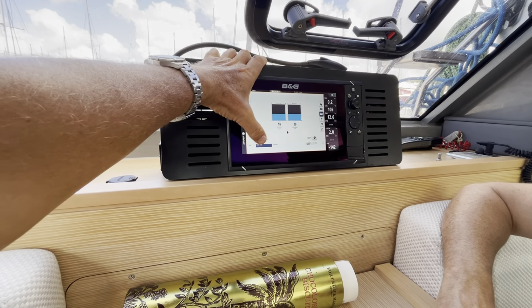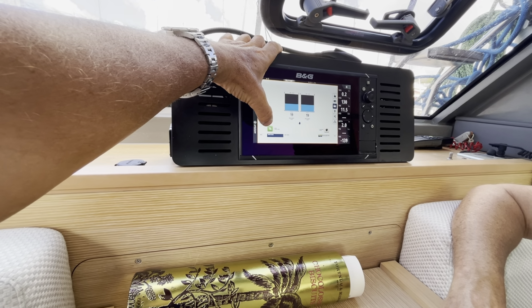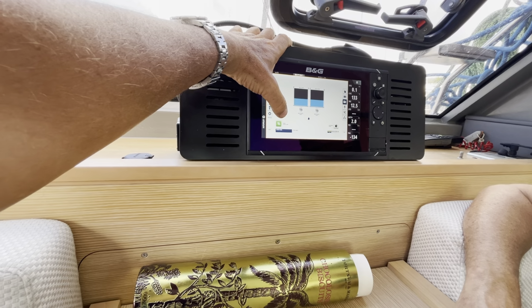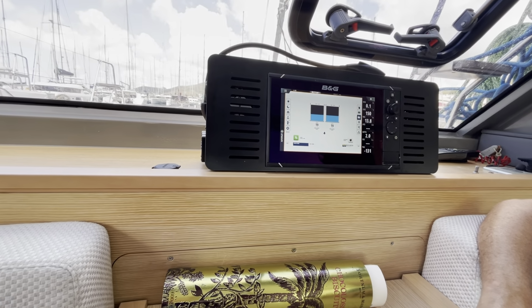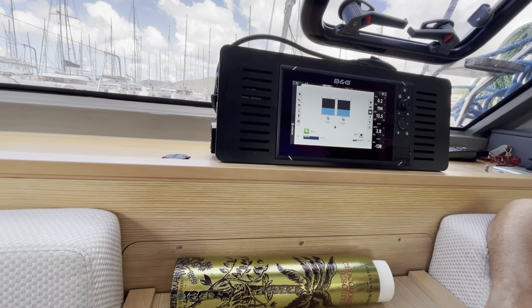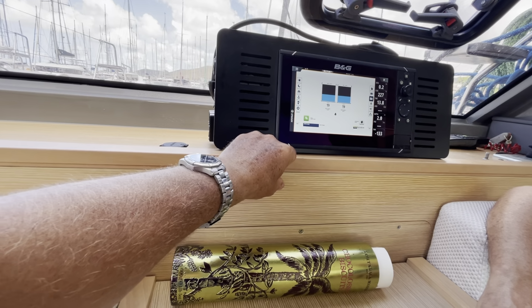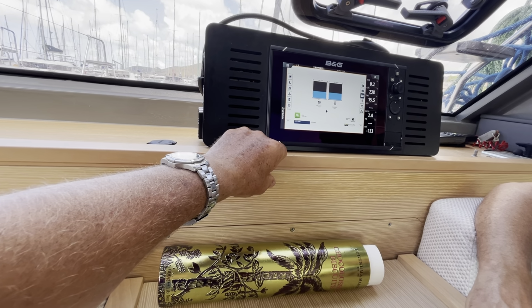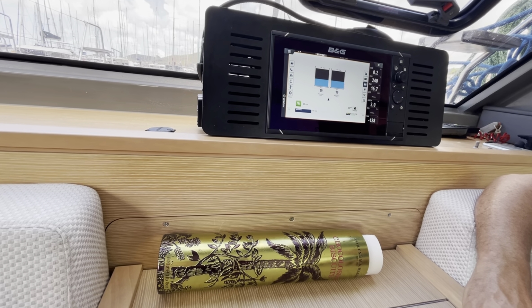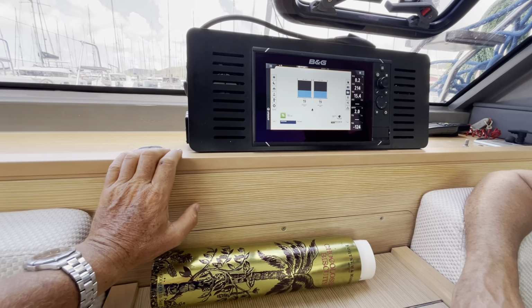Liquids, so water tanks. Again, another freshwater pump there. So if it turns itself off, you reconnect there. The freshwater pump has a trip out. If it picks up an airlock or something like that, it will just stop running. That will remain green. You just turn it off, turn it on again, and it goes. We'll go through that. The pump itself is very reliable. The only problems we've had are with the filter, which I described.